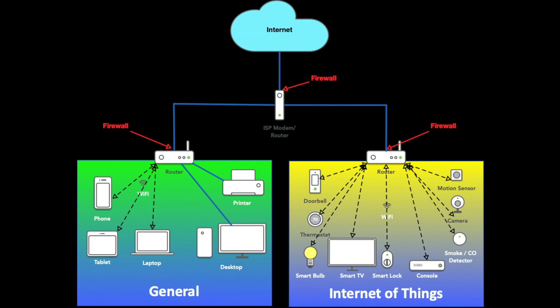Security is often the most neglected part of a smart home because it's kind of the most confusing and ultimately seen as not quite as important. Good modern routers already often have good security built in, but it doesn't hurt to have that extra layer of security by segregating networks. Most routers at least have the option of creating a guest network, which basically just gives those devices basic privileges to your internet connection but doesn't let them communicate with your main network. Your primary network will have all devices with personal information on them like your computer, your phone, your iPad, and then your smart Wi-Fi bulbs, TV, and Xbox can all be on the guest network.